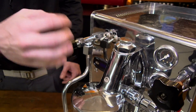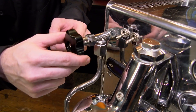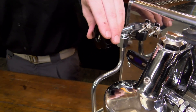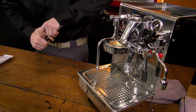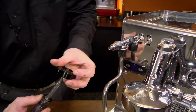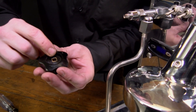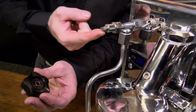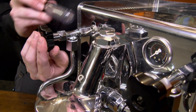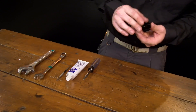We're going to start by opening the valve all the way. The reason we do that is the actual stem needs to be unthreaded to pull all the way out, and we have to take the handle off first. So we'll take our Phillips head screwdriver and take this screw out. Sometimes the brass bushing in here can get worn and get hung up — just take the heel of your screwdriver or wrench and give it a couple of taps on the side and you can wiggle it off. This one cooperated, so we'll take it.